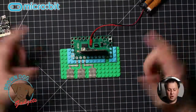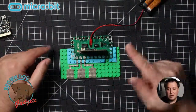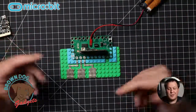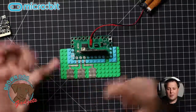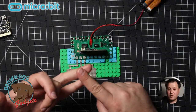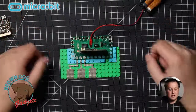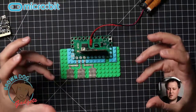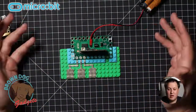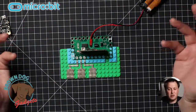Yeah. So what we could just do, we've done before, is run our nylon tape from an Arduino, or in this case, micro:bit, to one of those bricks. And now that brick, or any other bricks connected to it that are also chrome, since chrome is conductive, become a touch point. Or we could do really anything conductive. We could do a ball of Play-Doh. We could do a cup of water even, because there's a lot of capacitiveness in that. Really anything metal or conductive in general, the more mass I find, especially wet mass, the better. So a ball of conductive Play-Doh works really well, or a big pancake of Play-Doh. We've also used bare conductive paint, which works really well, although it takes a while to dry. It's like a puffy paint.